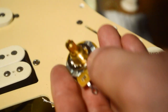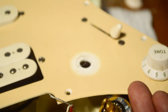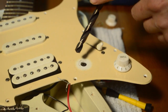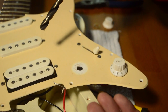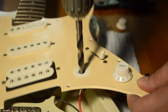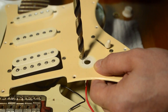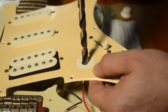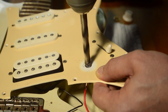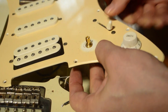We've run into our first snag — the diameter of the new potentiometer's shaft is a little bit larger than the hole cut into the faceplate from the old pot, so we're going to have to deal with that. The largest bit I have is actually a little bit too small for the hole, but we're going to make it work. Making sure I have clearance and won't hit anything inside the guitar, I place the bit in and go around the edges, applying pressure to the outside of the faceplate hole to make it a little bit larger. Nice and easy — check as you go. Don't go too far; you don't want it too big and too loose. You need just enough space to get the pot in.